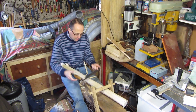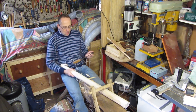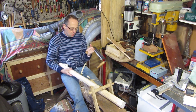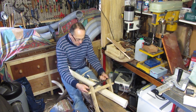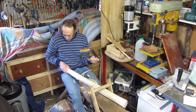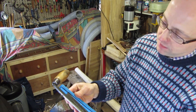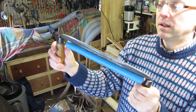You can take massive chunks of this and it doesn't really blunt the blade, so I don't sharpen my draw knives very much. If it gets really bad I'll pop it on the water wheel and give it a bit more of an edge, but otherwise I just rub it with an oilstone now and again and you can get the edge up. I do keep my edge tools with covers and I find that really helps. It's not very green-woodworky but I use blue water pipe — recycling I suppose, even if it's not very traditional. A bit of water pipe makes a very nice blade cover.